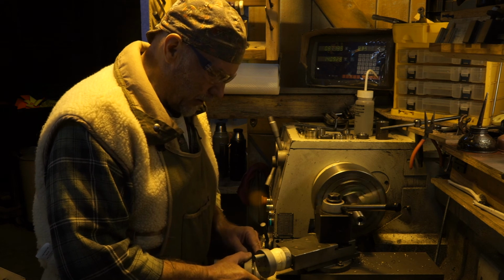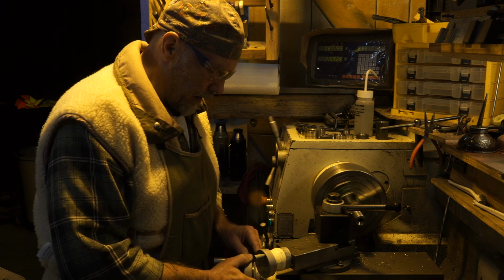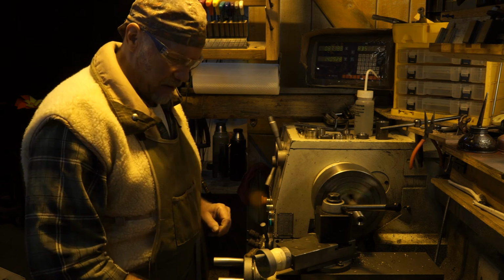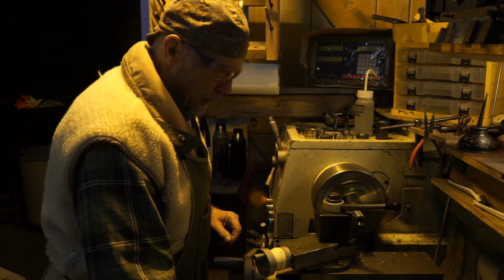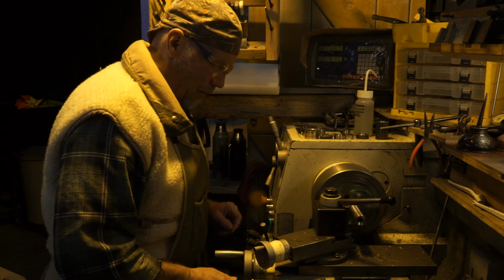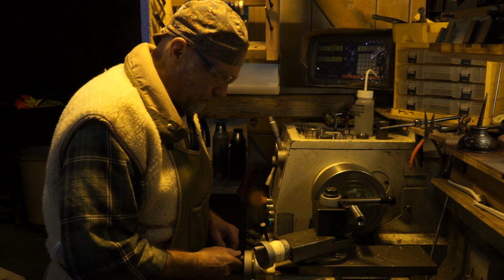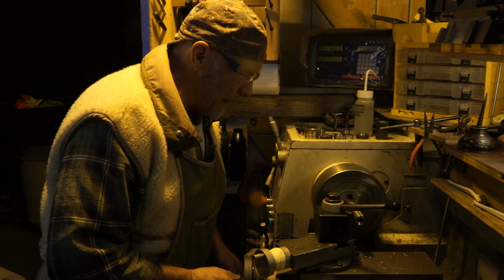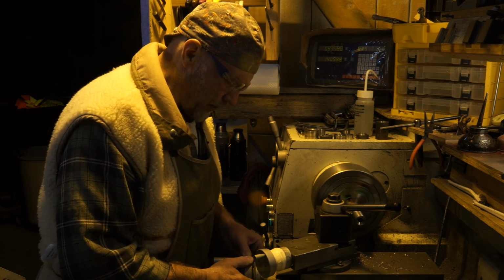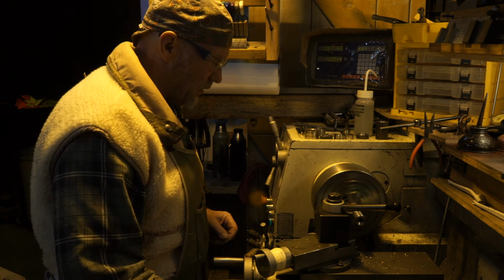We're getting down in the dirt here. We're getting down to within 10 thou. Bottoming this thing out, within 8 thou bottoming it out. Make sure I can get these cuts to clean up. Make sure I don't inadvertently drop in on the wrong joint. Make sure I back it out far enough without throwing a full revolution in and wasting a bunch of time that way. I'm going to make a single pass here now, just a single thou.